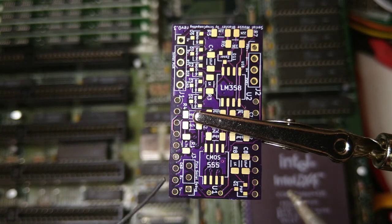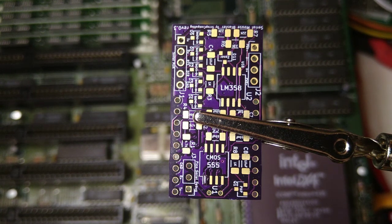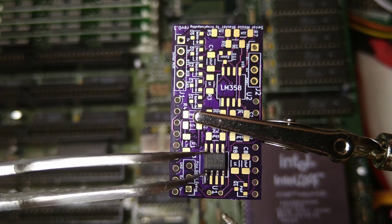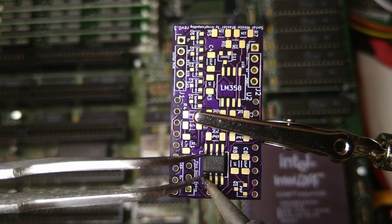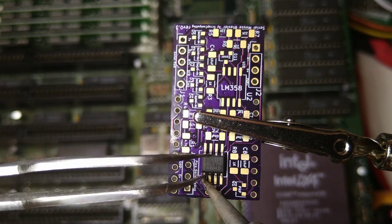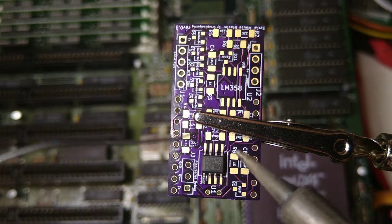Let's build it! I am not great at soldering SMD components, but I find it easier to add a soldered blob on the PCB for one of the pins before attaching the component. Soldering the first pin is quite easy — you just need to melt the soldered blob without adding any new solder. After the first pin is soldered, the component is usually secure, so we can solder the rest of the pins as usual.